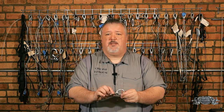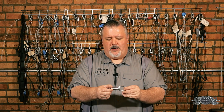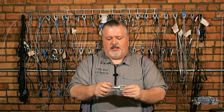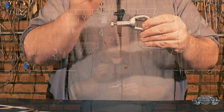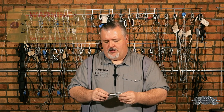Let's take a look at the other device we want to talk about — called a Verloc from the Versailles company in California. This device is going to consist of an eye nut — just a regular forged eye nut, the same as we would use for other rigging applications — and then the body of the Verloc itself. The way that the body works is there is a screw on the end with a knurled edge so I can finger tighten it. As I loosen it, I can push it in and there are springs inside that release the capture mechanism. This is designed for 1/8 inch cable, not for 3/16.